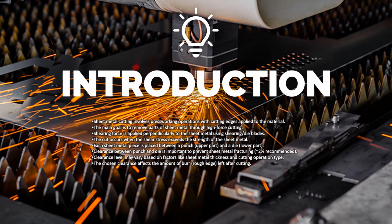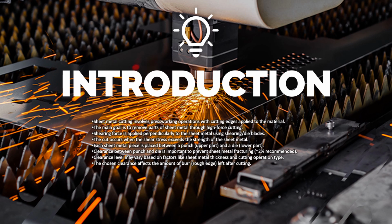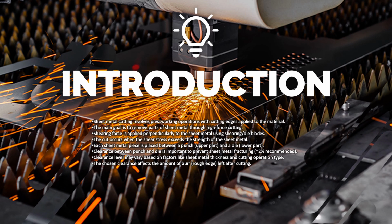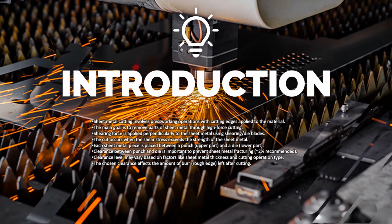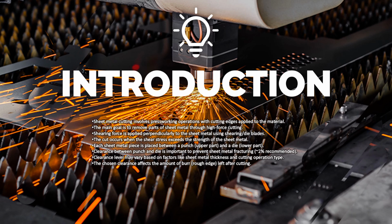Sheet metal cutting involves press working operations with cutting edges applied to the material. The main goal is to remove part of the sheet metal through high force cutting. Shearing force is applied perpendicularly to the sheet metal using shearing or die blades. The cut occurs when the shear stress exceeds the strength of the sheet metal.